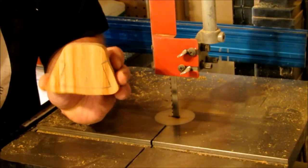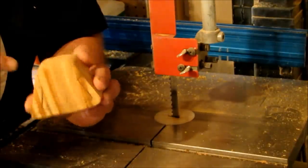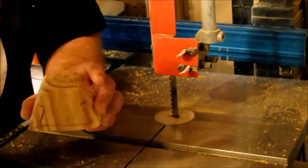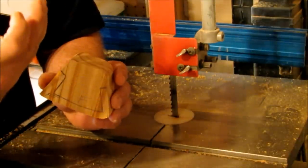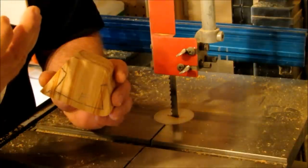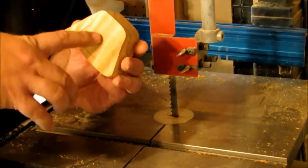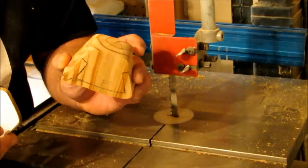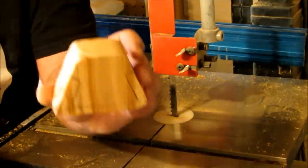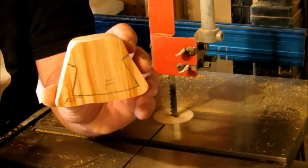After looking at these drawers, normally I would cut out straight in from the top, but I'm not going to have much of an opening at all since these are tapered for the tree. So what I decided to do is leave the front full size so it will fill in the rest of the box. And then for the drawer, I'm going to be cutting down quite a bit so it'll have more room. I may cut the back down as well, but I'll decide that when I get to that point. But I've just sketched in a basic inside door design, so I'm fixing to cut that out on the bandsaw.